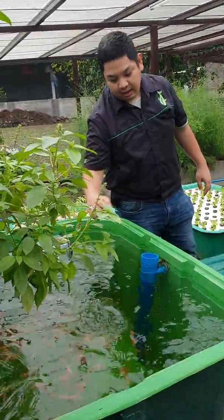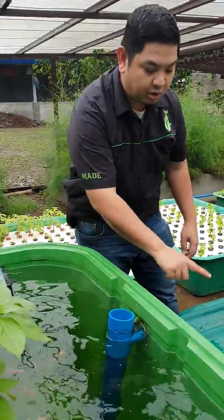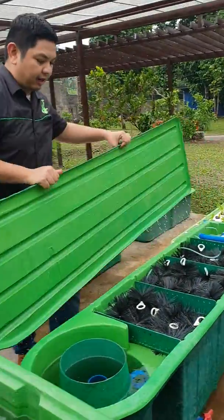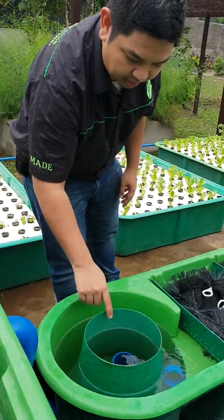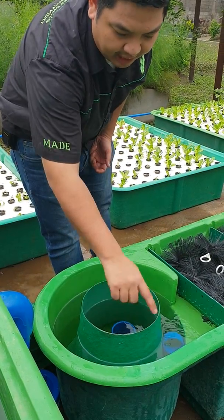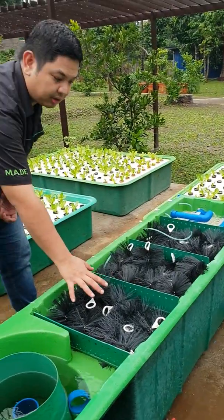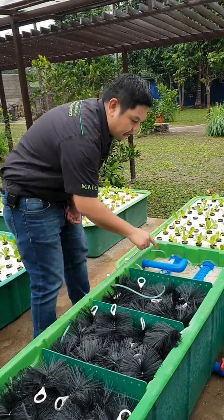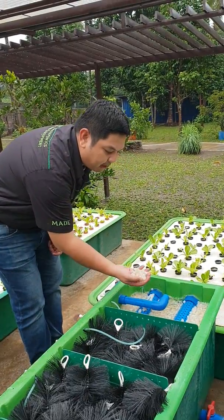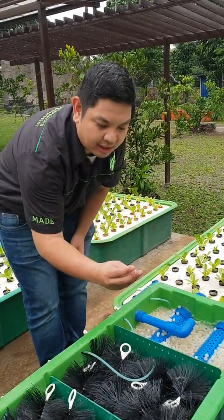From the fish tank, the waste of our aquaponic system exits a standpipe into our filter. Here is our radial flow filter, and here we have the exit of the fish tank. Water exits the radial flow filter to the next stage which is the brush filter — another brush filter, then another brush filter, and then our K1 media. Our moving bed bioreactor contains a media which houses good bacteria and converts the ammonia into nitrates.